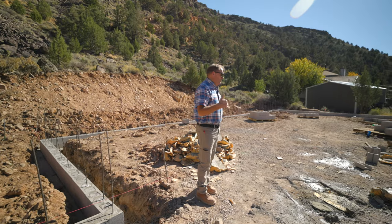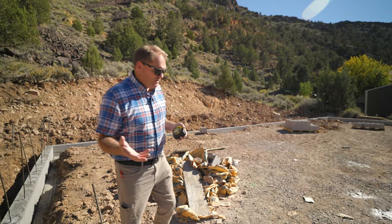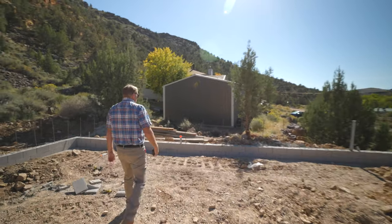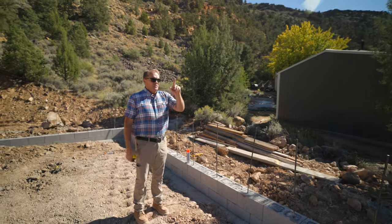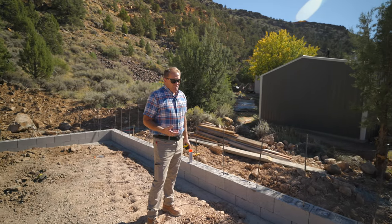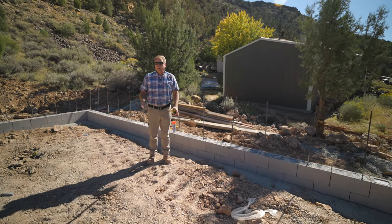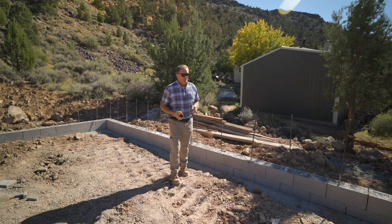I want to walk you through a couple things over here and explain what we did and how you want to avoid some possible mistakes down the road. Whenever you do a slab on grade, you want to watch where your plumber is going to punch out. I talked with him on the phone, and I have a footing over here all along this wall here. I did the excavation work on this job — I had it rolled, it passed. You can see right here these divot marks. I had a big roller come up here right after a rainstorm and it just compacted everything. We passed with a 95% compaction test.